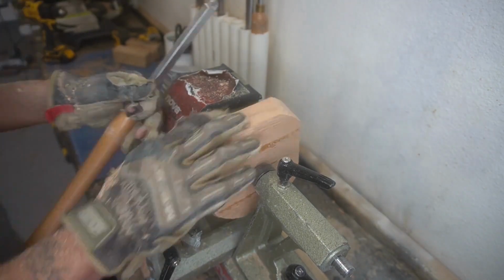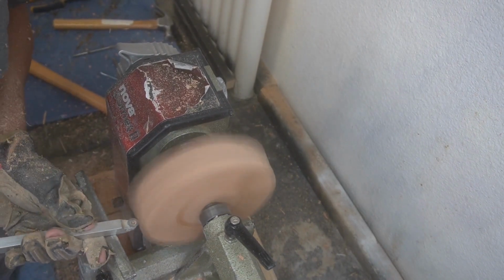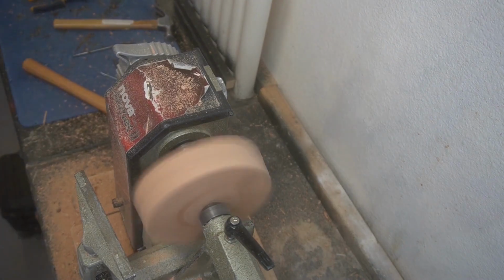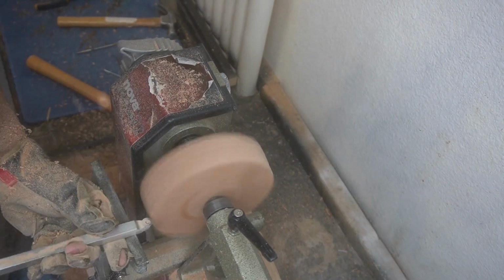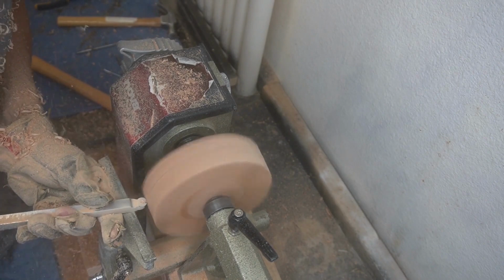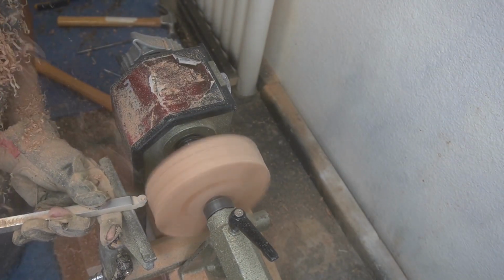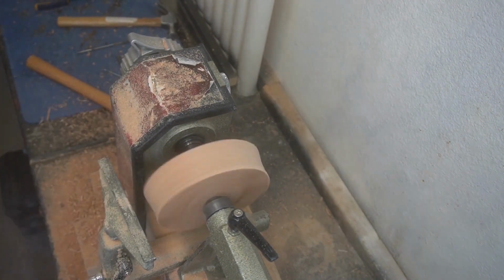But the reason why I didn't want to do that initially is because typically with my bowls, I make a mortise where the tailstock is, and then I flip it over on the chuck, and then that allows me to go ahead and gouge out the bowl. But on this one, since I can't do that, I'm going to have to do something different. So I'm going to go back old school and end up making a tenon. And you guys will get to see that here in a little bit.